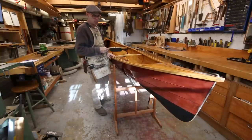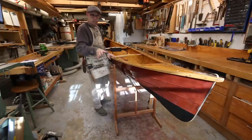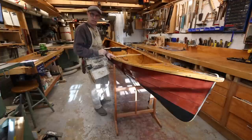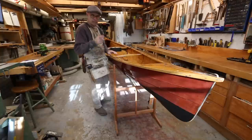That's because the materials are very easy to source — marine plywood is readily available and requires very little milling to get started. We don't need to stuff piles of cedar through a thickness planer, table saws, and routers. We're simply starting with sheet goods. We have to learn a little scarfing, which is not difficult, and from there it's a very straightforward process.